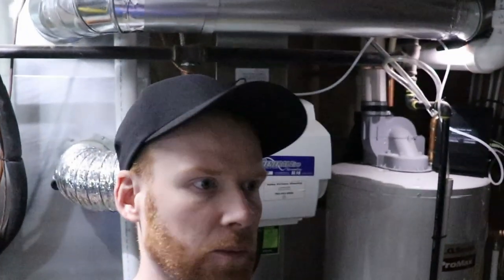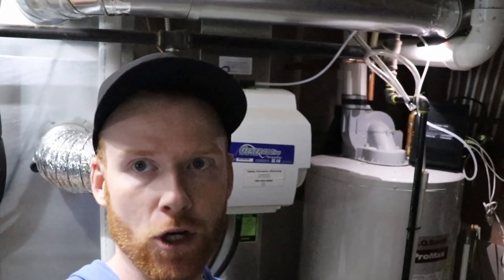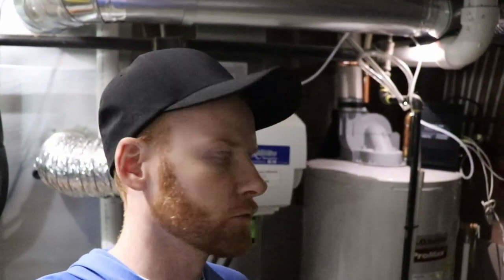That was it. And how he knew is because apparently he was filling a bathtub, and it basically looked like rusty water. And that's the reason, because the tube did its job, was the sacrificial piece, and not rust out the tank, and it's time for him to replace it. So, again, his house, same as mine, same meter, and it's been about 7 years. We didn't know about this until I guess his failed, and we looked into it, and that's the reason why, and why you should change it every 3 to 5 years based on your manufacturer's recommendation.